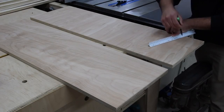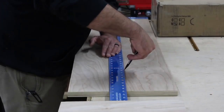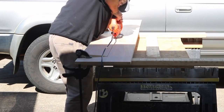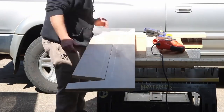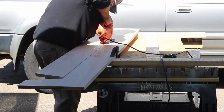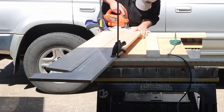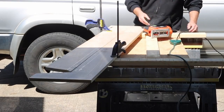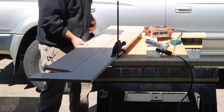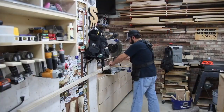The first thing I do is just break down all the plywood, and then I'm going to add some design elements into this bed, making all of this out of plywood. I'm going to be adding in some angled legs and cut out all of the sides and ends with a jigsaw to give me my leg profile. One thing I learned through this process was that I needed to just trust the jigsaw and let it do the work — I tried to rush a couple of cuts and my blade started wandering.